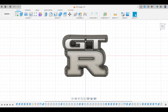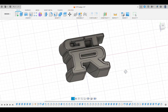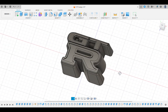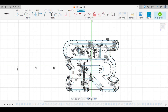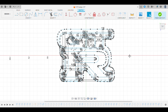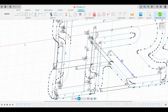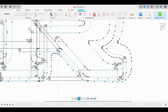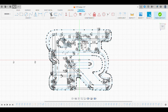Jumping ahead, this is what I came up with trying to recreate the original. Unlike in my previous video where I modeled the front lip using mesh surfaces and modified them by hand slowly, this time I've gone with sketches that I can dimension perfectly, working with extrusions to get my base shape in a good place, which I can then edit with chamfers and fillets as needed. There are definitely some more details I can improve upon, but sketching this up took a significant amount of time — I'm not a master modeler. Even so, I can work myself through something like this, and I will be uploading the STL file of my scan as well as my own recreation for you to check out, improve, or redo entirely.